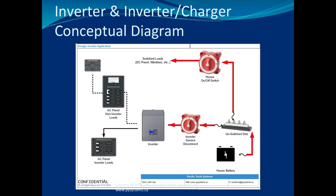And what I was emphasizing yesterday is that, for the large part, and remember, all rules have exceptions, 99% of you have an inverter charger with only one single DC positive connection to it. Okay, only one. Inverter chargers, by definition, can only be connected to one battery bank. That's it. Your inverter charger does not connect to four battery banks. It's not a charger only, it's an inverter charger. And since it's only going to have one DC positive connection to the device.